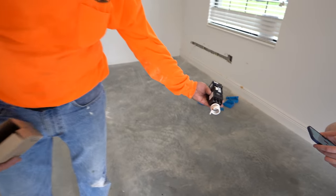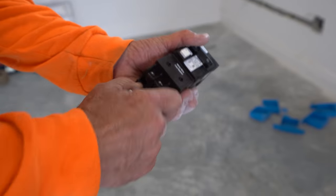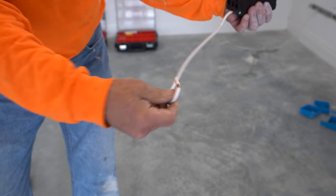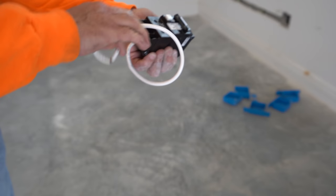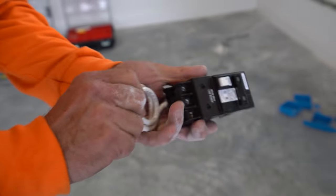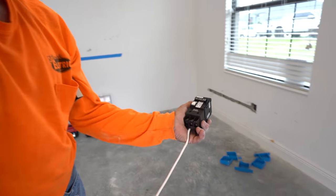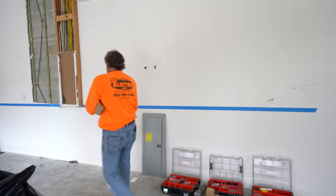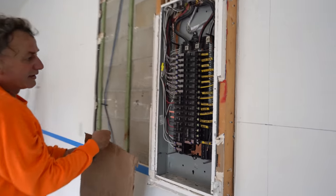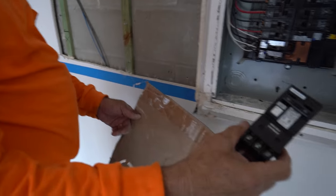We need a meter - or a 60-amp breaker for the Tesla charger. It's a really nice breaker. You'll always see this in the panel - it's for the wire packing. You're supposed to completely unroll that wire and cut off the excess when you go into the neutral. A lot of times you'll see it wound up, but if you loop it too many times and put an amp probe on it, it reads three times whatever is actually going through the wire - and those loops together cause heat inside your panel. Always unwind them. That breaker cost about $140.